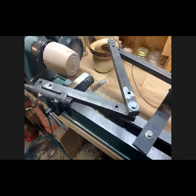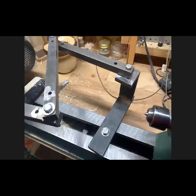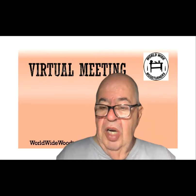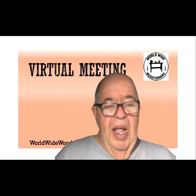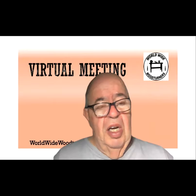I don't know if you can see that guy. Is that solid stock or tube stock? No, it's solid stock, but it's 3/4 by 1. It was some scrap that I had come by at work. As long as the vibration doesn't get you, you can stabilize it and keep the vibration out. It'd work. Yep, I hope it will. Well, thank you, sir. Appreciate you sharing it tonight. No problem. There are many commercial type hollowing tools out there. This was one I saw 20 years ago, and the guy had made one out of 1.5-inch solid stock. So the first thing I did was go buy a bar of 1.5-inch solid stock. Then after I picked it up a couple of times, I decided to go to 1-inch solid stock. But as long as there's no vibration, it works fine.